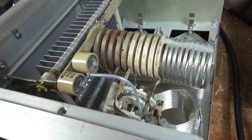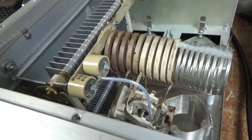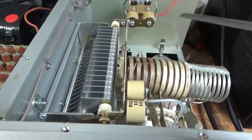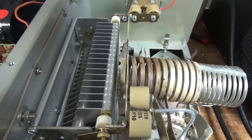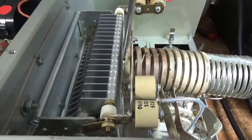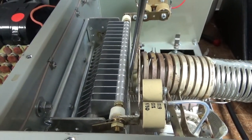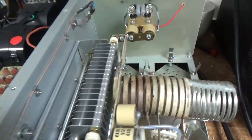I've seen that happen before. It could have happened when the amp or the capacitor was being built. It looks like it was run hard on 10 meters — you can see the coil's discolored, but that's fine, it's working fine on that band. I pinched the coil closer to this strap material here, because it was really close to the air variable capacitor. The rotating plates are at ground potential, so it could end up arcing if it's too close. That's all set.